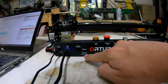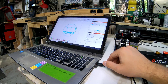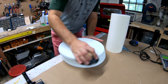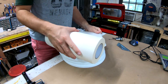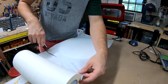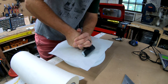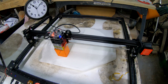Here we've got it plugged in. I'm going to press and hold this button to reset it and get it going. I plug it into the computer and I'm using a program called Lightburn. Here I'm preparing some wood for a job — I'll sand it a little bit, add some masking to it, cut it off, and then use the sprayer tool to press it down nice and tight. There are many different ways you can use your laser; this is just one technique I use to get very consistent results.